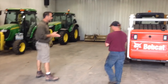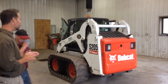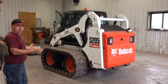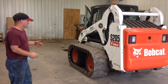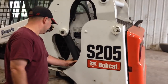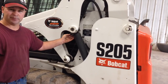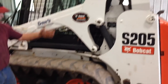This is a used piece of equipment, so this is the perfect thing to go over. If you were in the market for a used Bobcat, the first thing you're going to look for is any visible leaks on the outside of the machine. The best thing to do is a walk-around, look at any of the cylinders. You may see what looks like a possible oil leak, but if you look, it's just grease from the grease being hot — there are no drips or anything.